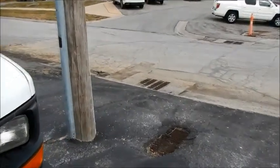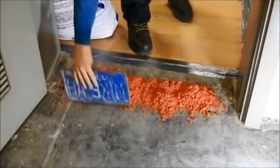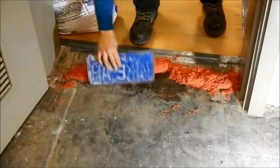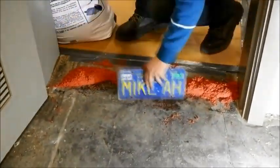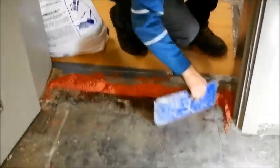You also have to make sure the product is very thin and it runs. If the floor is not level, the product will tend to go in one direction, so we always create a small one-inch barrier of absorbent at each door so the product doesn't go outside the project area we're trying to treat.